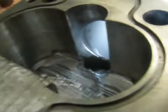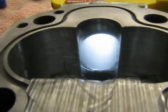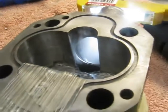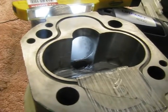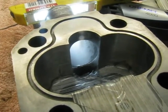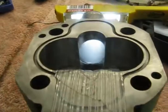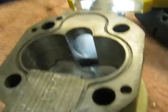Well, there's the final product. Both sides blended nice and even. I don't have a flow meter, but just looking at it tells me that it's a whole lot more open, a lot less restrictive than it was earlier. Removed a fair bit of material, and just by feel there's no more sharp transition between the intake pipe and where it dumps into the pump. The top side was blended a lot and it's got probably about a half-inch radius on it. That should be enough to get it running solid and see what it all looks like.